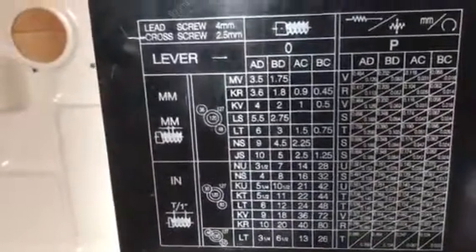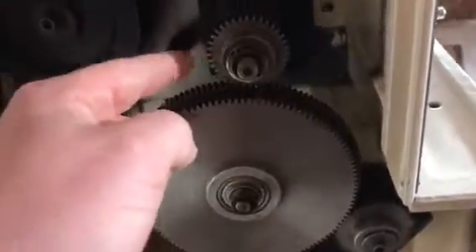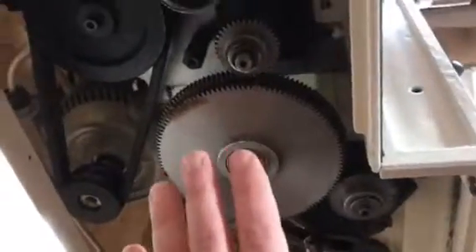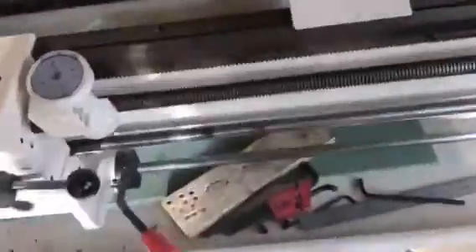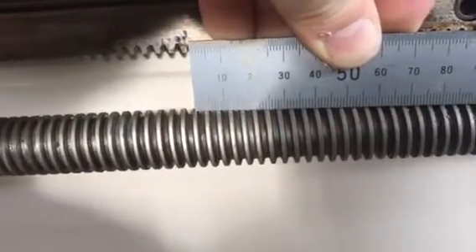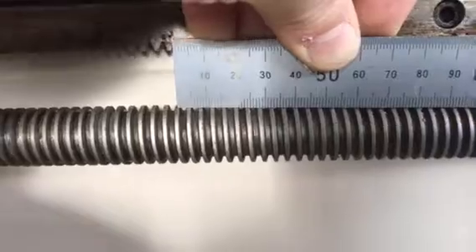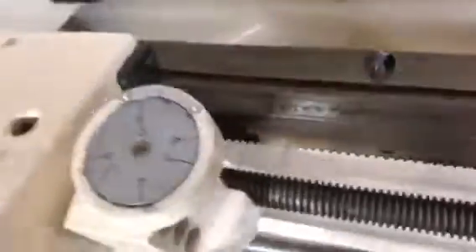First of all, I have set up for millimeters: 36, 127, and 48 — that's four millimeters, and that's what I have on now: 36, 127, and 48. My screw is five threads per 20mm, so ten threads per 40mm. That's the screw I have.